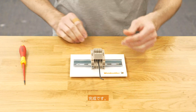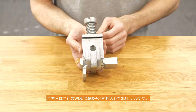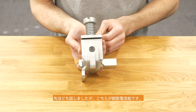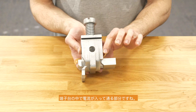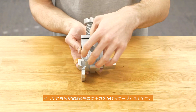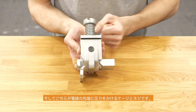And it's done. But how does it work inside the terminal block? Here we have a big 3D sample of our WDU 2.5 terminal block. Inside we have the current bar made out of copper, which carries the current flowing into and through the terminal block. We also have the cage and the screw, which provide the force and the power on the wire.